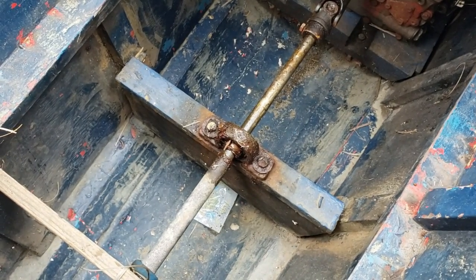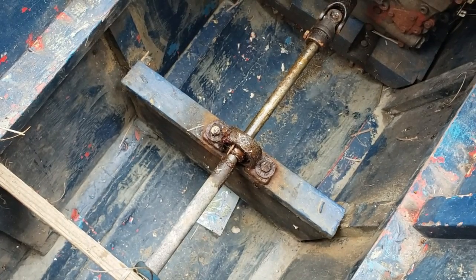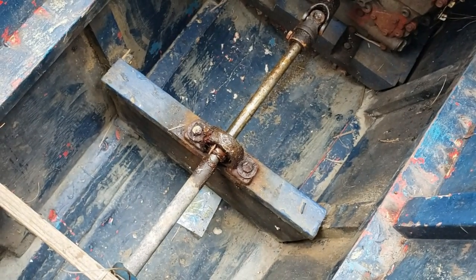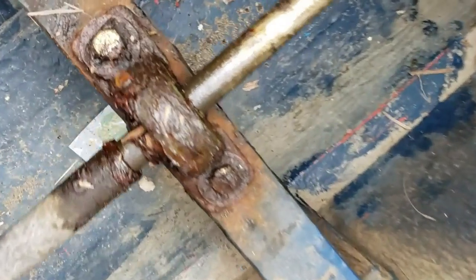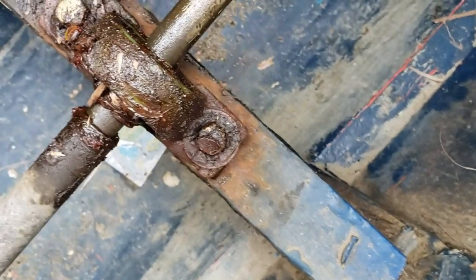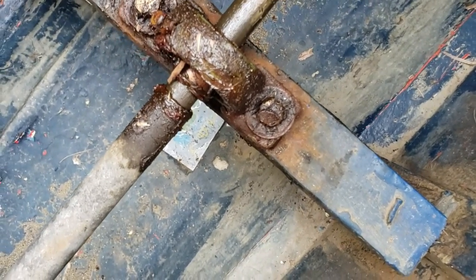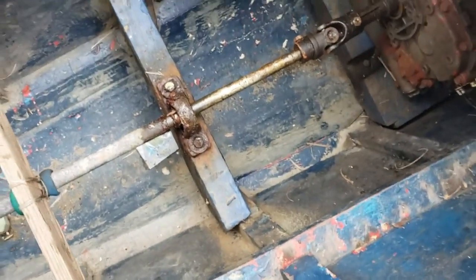Once they do get the alignment correct, if you don't have it already, you're going to need to go back to the same place you bought the cross joint — they'll have that carrier bearing there too. Put that on; it's got a grease zerk so you can grease it every so often. Leave it real greasy on the outside like we had — don't try to make it pretty, leave that thing dirty and greasy, because grease means no rust.